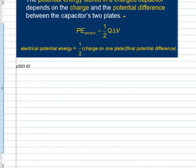A parallel plate capacitor has a charge of 6 microcoulombs. So if I have a charge, looks like they're using capital P here, microcoulombs, that's 6.0 times 10 to the negative 6 coulombs. Always love having our basic SI unit. And it is charged by a potential difference of 1.25 volts, so the potential difference is 1.25 volts. And that doesn't look like a V. This looks like a V. Find its capacitance.